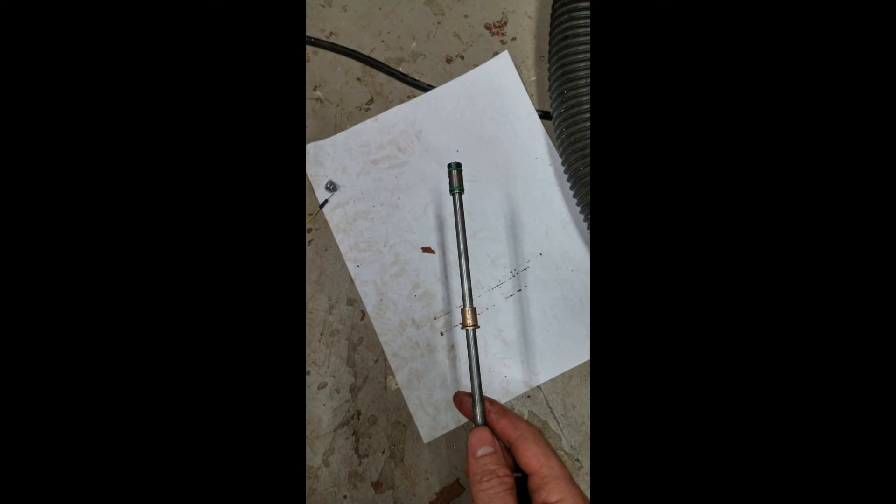This was the hardest part where I actually made the cylinder. I had to bore out those spots for the rubber gaskets, and then for the other end I decided to go with a brass spacer that was flanged — that will make more sense when you see it together.